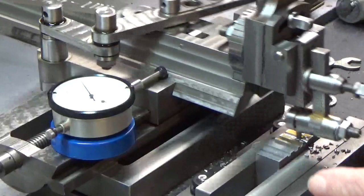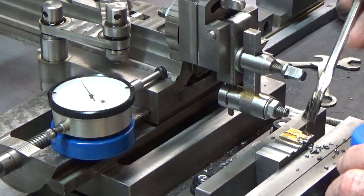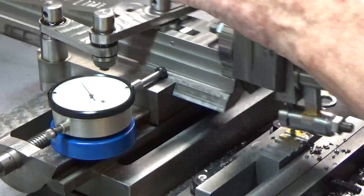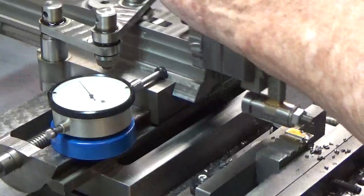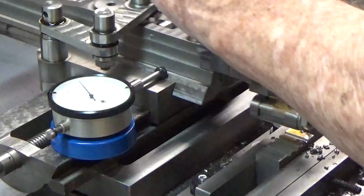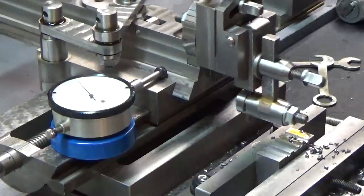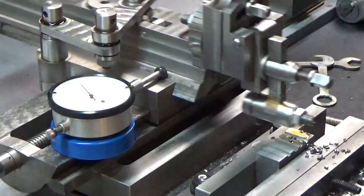Okay, we're down about forty thousandths. I'll put a little bit more oil on the cut. The graduations on the dial are fifty thousandths — that's what there is. Back to zero again — that's where I'm headed. Okay, there's zero again, so supposedly we're down fifty thousandths. We're going to make some spring passes here to make sure we've cleaned out the slot.